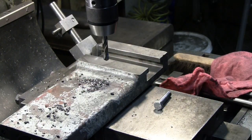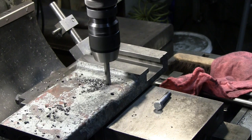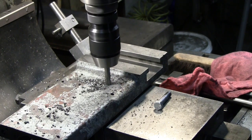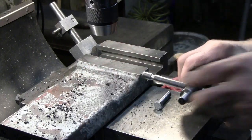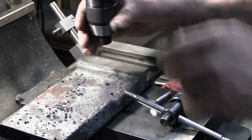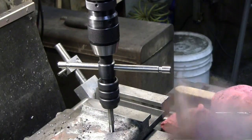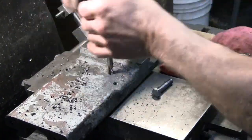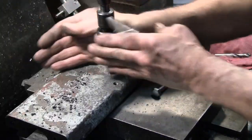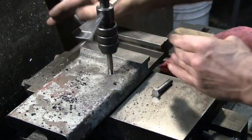Now for the 3/8-inch clearance hole to clear the threads — about a quarter of an inch. Now I'll drop this down and get my tapping tool in here. That's a nice sharp tap. I may have to counter bore a little more than that to get full threads down there. It takes about an inch and 3/8 to get all the way through that — I should have checked that on the tap.